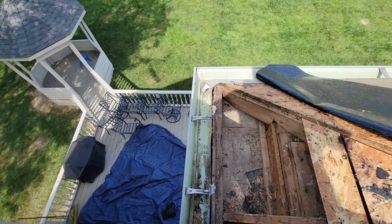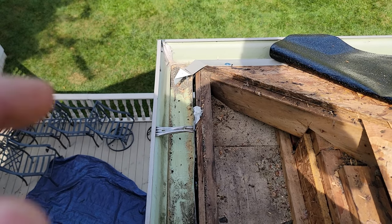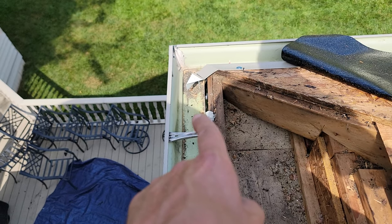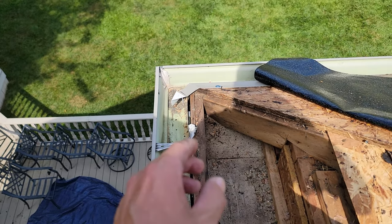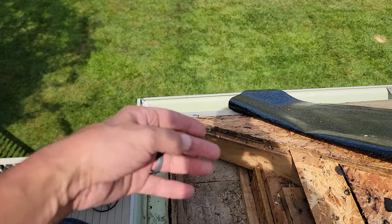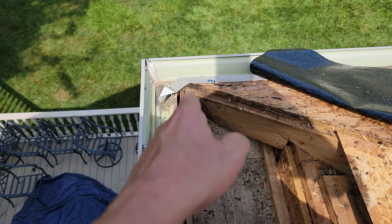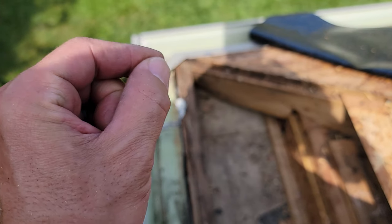The other thing he noted — see that handrail shining through that gap between the fascia board and the gutter? He had water dripping down through there. This roof was built probably in the 90s, the gutters were put on at a later point, and the edge metal they had was going behind the gutter. Anytime you have an apron or edge metal drip, it needs to go over your gutter. What was happening is it was just dripping in. Also, some people don't hang their shingles down far enough — it doesn't give a drip edge, so water comes off the edge of the shingle and wicks back up under.